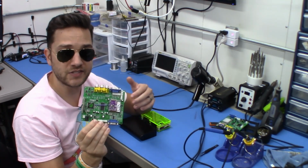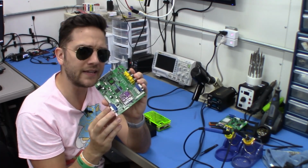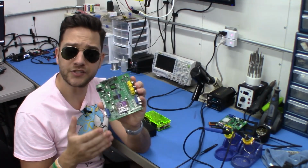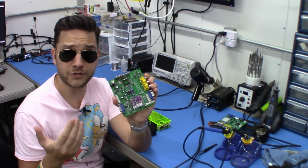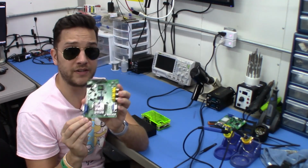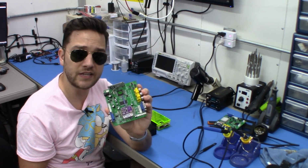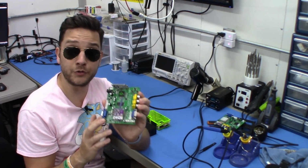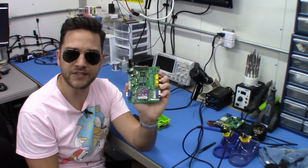This is a GBS. Now, this GBS 8200 was primarily designed, I believe, for arcade vendors to repurpose cheaper LCD monitors into their video game cabinets without having to source what are currently now hard to find CRTs. Now, this device on its own is a piece of crap. It processes everything as an interlaced signal, and the latency is pretty significant, but Rama, in his infinite wisdom and ability, has produced a custom firmware that, oh my gosh, guys, makes this device amazing.